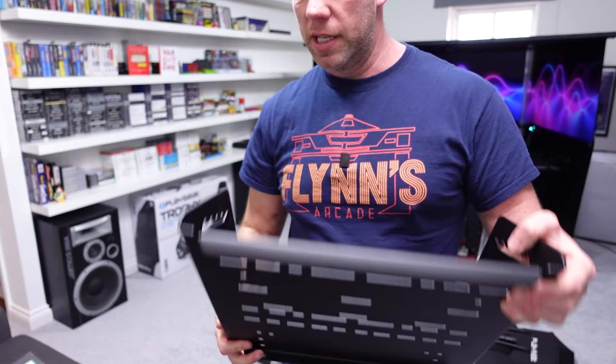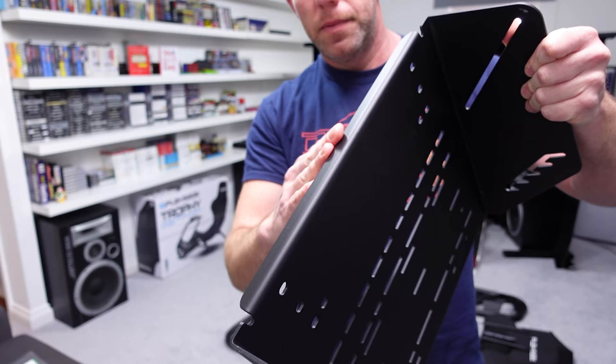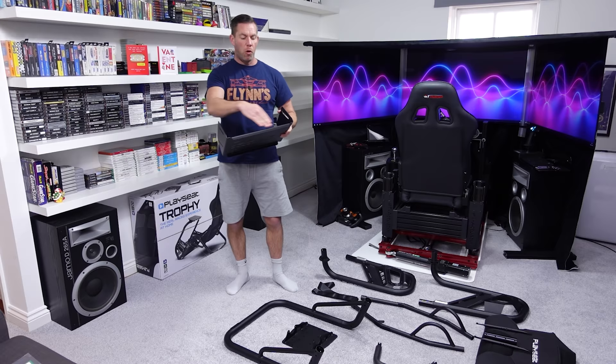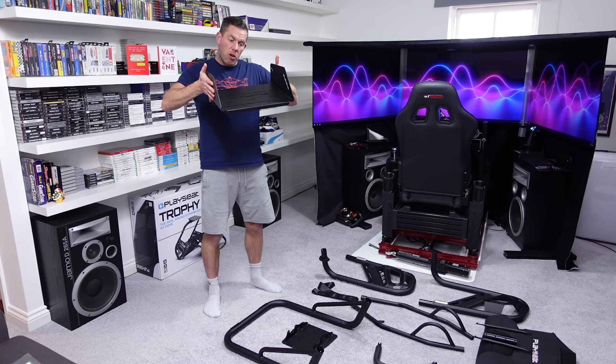What concerns me about this wheel deck is there is no bracing either crossways or lengthways — none whatsoever. The only rigidity is provided by this 90-degree bend here and here, and then the side pieces also bent at 90 degrees. That does provide a reasonable amount of rigidity because when you fold metal at 90 degrees it's really not going to flex very much across its other axis.